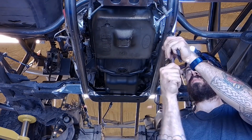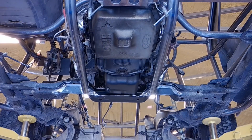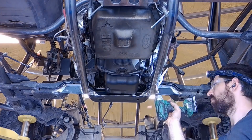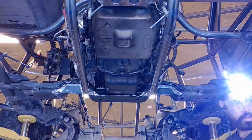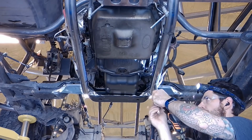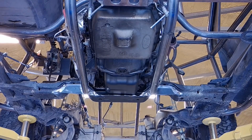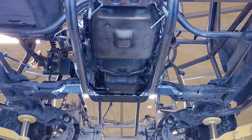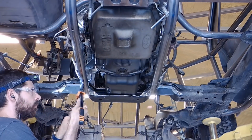And I thought about grinding that head and installing a different rivet nut, but I didn't want that little piece of metal floating around in the tube, rattling around while I'm driving. So I decided that I would just install slightly different size rivet nuts in the other 6 spots. But other than that little mishap, it went really well.